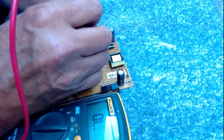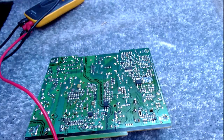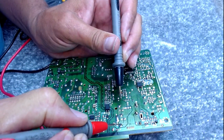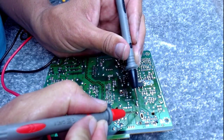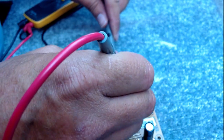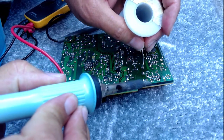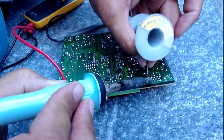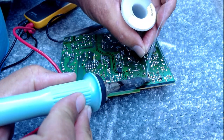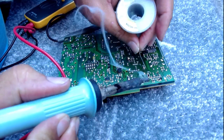That one isn't making contact — and that's the one. I'm surprised that's not making contact. There's a bit of trace disappeared from this board. It is working fine now, let me just see if it's loose. It's that one that's not connected — well, I haven't soldered that one yet, that's why. So let me just solder this. There's a trace missing from here as well. You have to be very careful when you take these out, but I might have to bridge that up with a lump of solder. Let me just see if I can bridge it across. Yes.